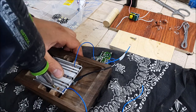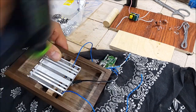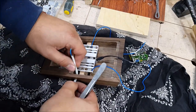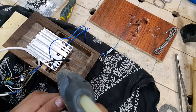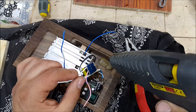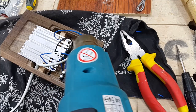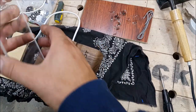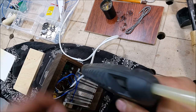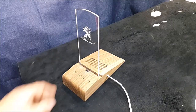I am fixing my cooling panel with two screws and pulling the cable inside the body. Hot glue is next — a very convenient way to fix anything. Heating the shrinking sleeves, and putting my acrylic glass panel in the slot. I am using hot glue again. Final assembly and my device is ready.